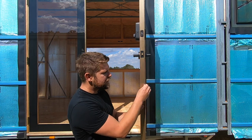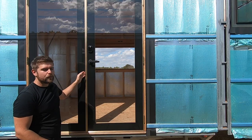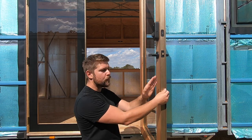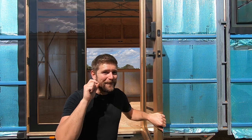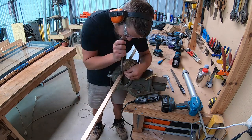Both doors are completely capped in brass, but a little bit different with the hardware. On this door I've done a little bit different where I have a polyurethane weatherstrip on a small piece of angle that goes onto the edge of the door. When this door closes, I get a weatherstrip that seals up against the other door - there'll be a foam seal so when it hits up against the other door, it becomes completely weatherproof and stops wind and rain pushing in between the gap. I've also cut the brass in around my door latches - I tell you what, that has to be one of the most tedious jobs I've ever done. The one lesson you learn the hard way is take a little bit at a time, because if you think you can take just a little bit extra, you go too far.